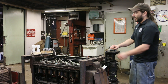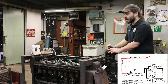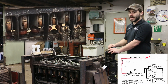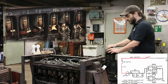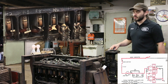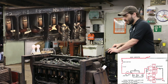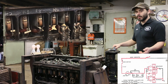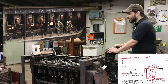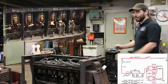I'll start notching through the different steps. Remember, the light bulbs on the left side are taking the place of the traction motors in the trucks. Taking the first point — you can hear some of the contactors move — and you see the light bulbs have both come on but they're very dimmed, because we're in first point, which is maximum resistance in the circuit.